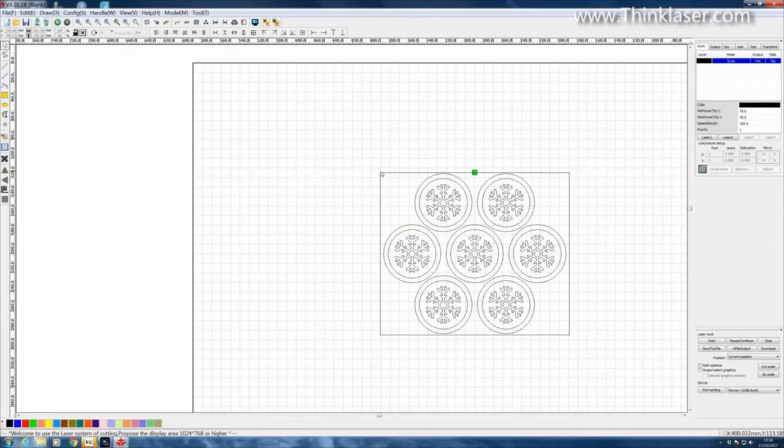And the rectangle that I've got here, first of all, the width is the width of the roller. And the height of this rectangle is the dimension of the circumference around the outside of the rolling pin. I've converted it into a flat surface, and then I've fitted an appropriate number of hole patterns into that rectangle.